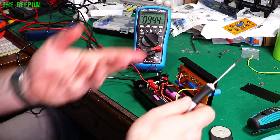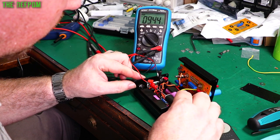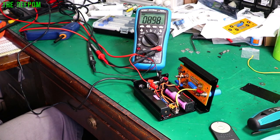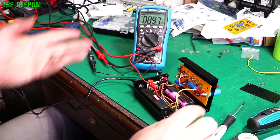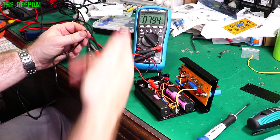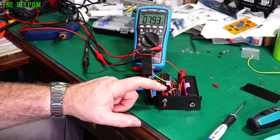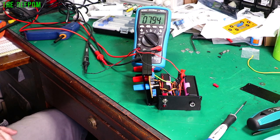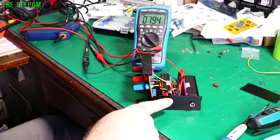These trimming tools are also from Fluke/Pomona — thanks to them for those as well, along with the banana jacks. I'll set it to about 9 volts, which gives roughly half a volt of overshoot, meaning decent charge current going in. As I unplug the charger it drops back to 8 volts as it should be. Let's see if the light comes on when I turn the switch — we do get a light. I've set the LED current quite low, only about 12 milliamps, based on the resistor I used. That's going to be a little variable with battery voltage but not too bad — it looks fine.